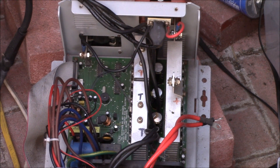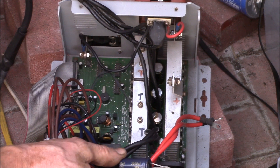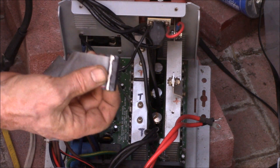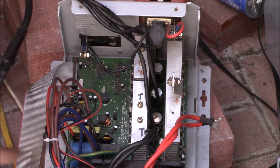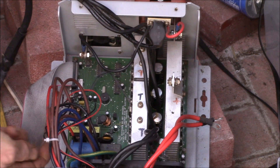This unit has many thousands of hours on it and I just need to replace the caps with better name-brand parts. These are real Panasonic ones — the highest-rated I could find on Newark: low ESR, high temperature, and long lifetime ratings. There's also a connection that goes to the control board on top, and what looks like a programming connector — a little pin header I hadn't noticed before. There must be a processor under there; hopefully I can figure out what it is.